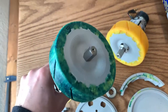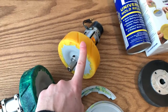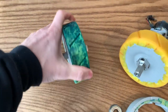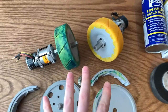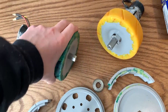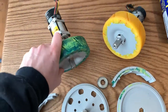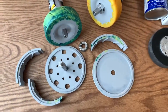That saves some weight and simplifies things. We went from 60A durometer on the first wheel to 50A on this one, and I think the 50A is probably better — it's a little softer. I'm not really sure how much it'll compress, so I'll have to bolt these to the robot and see if I have the right clearance. The robot this is going on needs very specific wheel sizes or else the weapon will smash into the ground. Hopefully this is the right size and it compresses just enough so that the weapon is perfectly parallel to the floor.